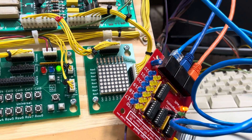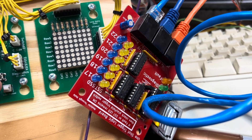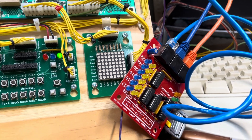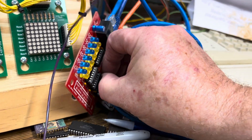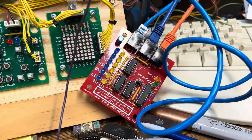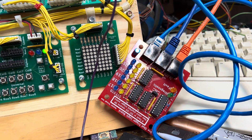If I power cycle with the fault alleviated, the fault light goes out because the fault's no longer there. And if I actuate the special solenoids, it will send the pulse out to that special solenoid. Let me switch the shunt jumper over to the other side and show you what that looks like. Now I'm going to power on, get into test, and we'll see how special solenoids operate — and it's the same way as before.